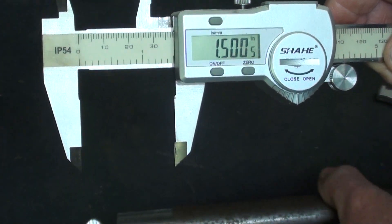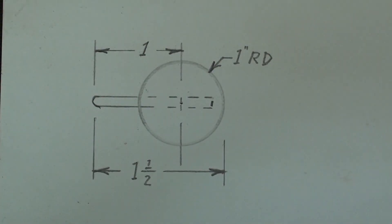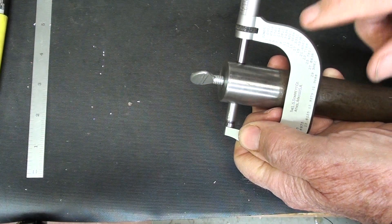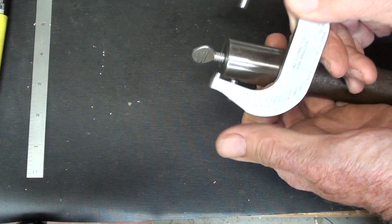Where did I come up with the 1-1/2 inch setting? I drew a little sketch, so let's take a look at it. Remember that the tubing out in the lathe is 2-inch in diameter, and this is an end view of this device — the feeler. Since the tubing is 2-inch, we want this to extend exactly 1-inch, but I have to take in the radius of the 1-inch stock, which gives 1-1/2 inch. That's why I'm setting it for 1-1/2 inches. It works best to make your setup with a micrometer — that's set for 1-1/2 inches — rather than the digital caliper. It's right on, or within a half a thousandth, so that's going to be just fine for this purpose.